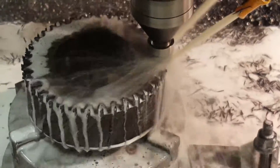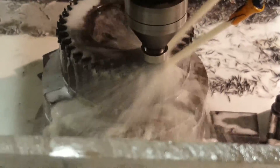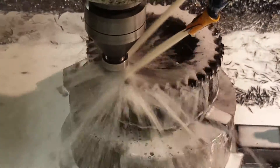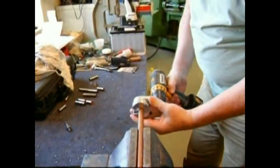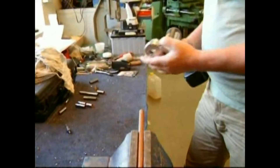As you can see, it's possible to mill a gear with a normal end mill in a 3-axis CNC machine. In fact, it is easy to make different special gears. In this case, I've made a gearbox with slotted gears. In order to be able to mill the gears without special tools or machines, I've modified the profile slightly.